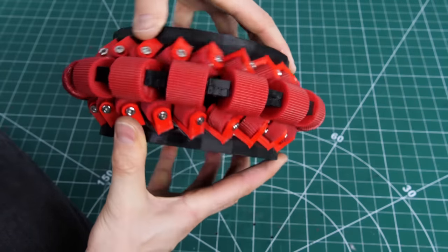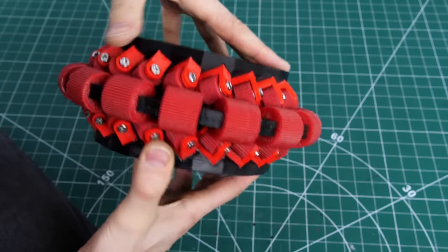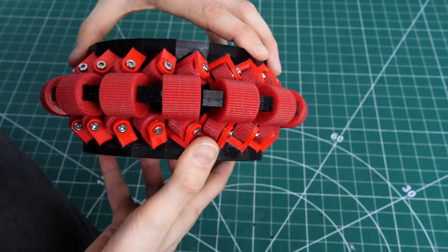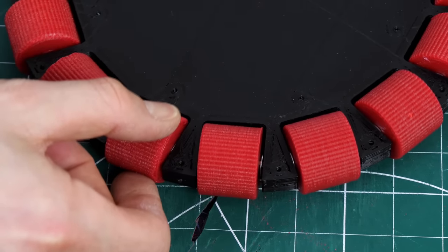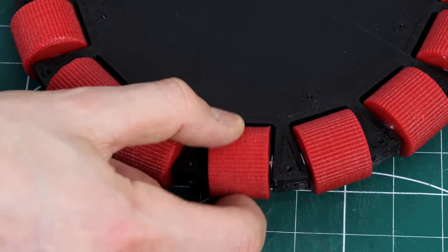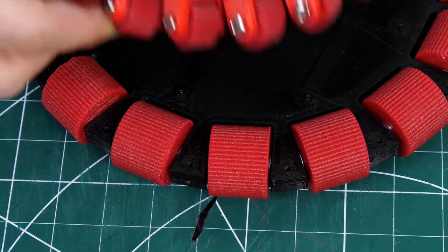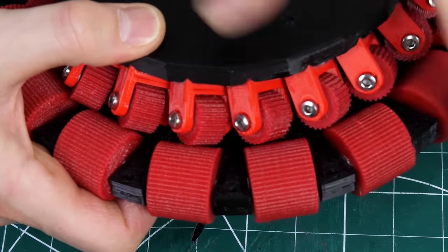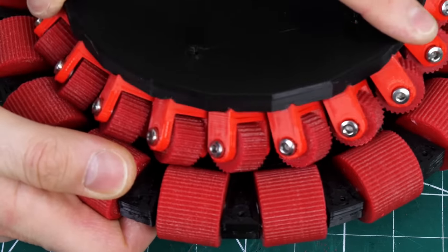So now we can just about see — if I rotate them against each other, the main output wheels around the circumference of the big wheel all rotate and that seems to be working kind of okay. My output wheels actually have quite a lot of slack in them so they run freely, but this has meant they're not quite in the same place as they are in the CAD once I apply pressure from the two driven hubs on either side. The result of this is that the smaller wheels on the driven hubs actually push them outwards and bind on the central mount plate, so we need to do something about that.